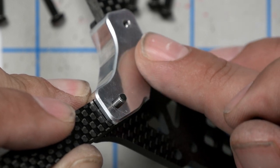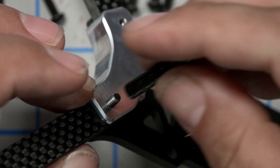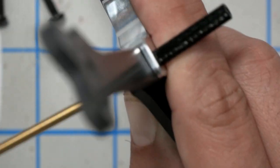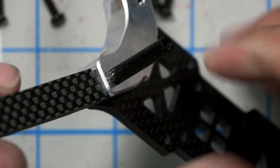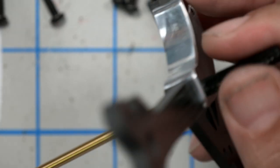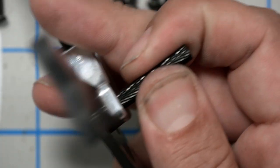So I sort of have a love-hate opinion of this. The upside is that this nice aluminum plate is going to act as the nut and tighten down really snugly and securely. The downside is: how are we going to get our standoff tight? Normally you tighten the standoff by tightening the standoff nut, but in this case the standoff won't cinch down that way. Unless you strip out the screw, the only way to get the standoff tight is to grab it and twist it down. That's a little bit of a shame. Maybe back it off a tiny bit — yeah, I guess that's going to be okay.